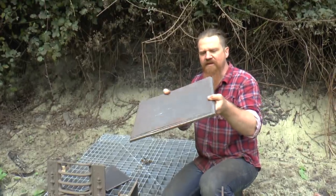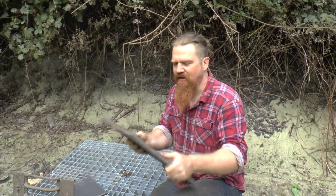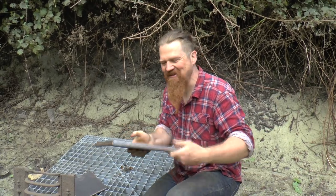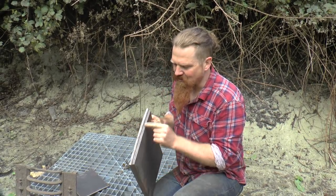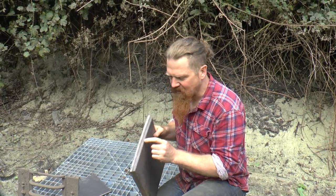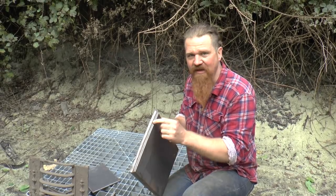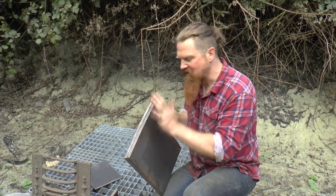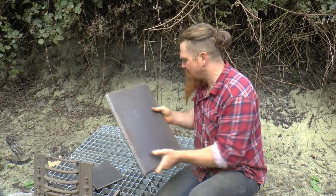These are brand new and I'll say adequately cast — no better than that. They've got machining marks where they've been cleaned up by whoever did the casting, which isn't really ideal, but I can rectify that by blasting them and taking this shiny edge off. That will sort of age them up and make the whole thing look a bit more convincing.